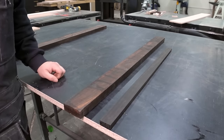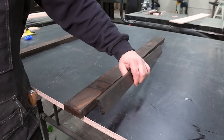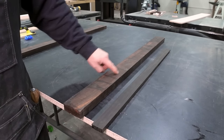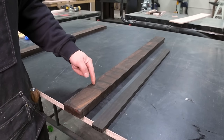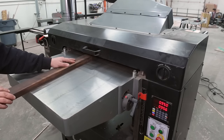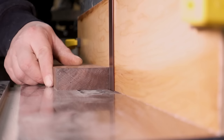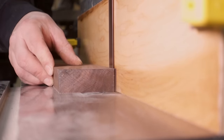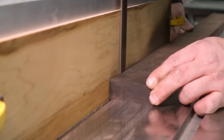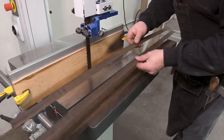With that fine-tuned, we can make the strips that will produce the beautiful inlay. Ebony will serve as the purfling, and there are several different grades. The darkest and cleanest is first grade or grade A. The ebony next to it is second grade or grade B because it has lighter streaks running through it. I don't have enough of the grade A, so I will opt for the darker portion of the B grade board. This board actually cost me nearly $100 alone and I want nothing wasted. Once the table has finish on it, the purfling will be pitch black. I cut strips off of the edge of the board as opposed to the face because it will conserve wood.